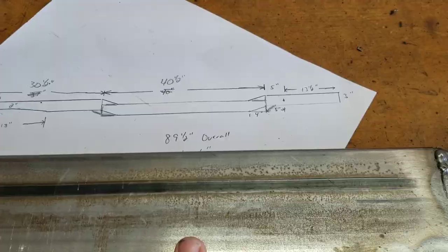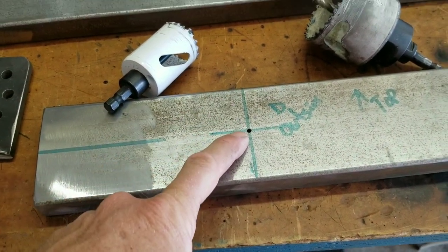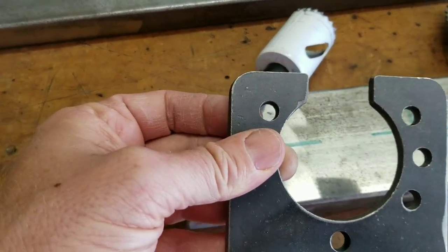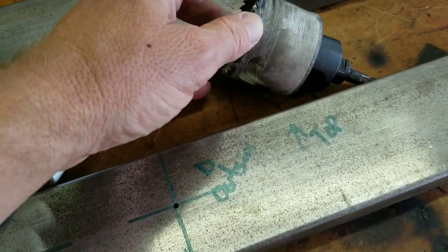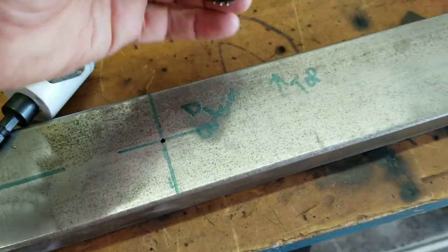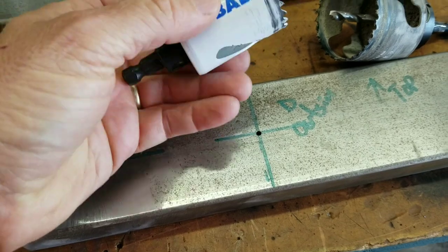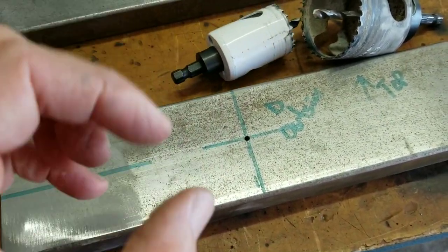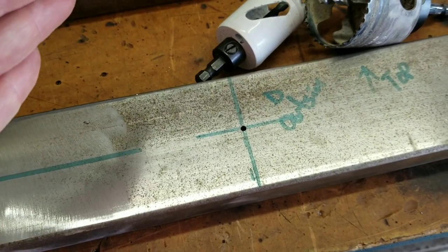I've measured out where the rear axle is going to mount — already marked it, centered at inch and a half from the top and inch and a half from the sides. The bearing mount is about two and a quarter inches diameter. I couldn't find a two and a quarter hole saw, so I've got a two and three eighths which is slightly oversized — that's okay because the two and a quarter fit is pretty tight. So we're drilling a two and three eighths inch hole on the outside. The inside hole is going to be an inch and a half — you could do inch and a quarter but it'd be really tight for a one-inch diameter axle.